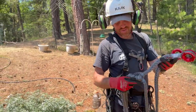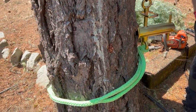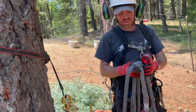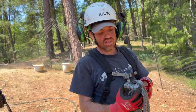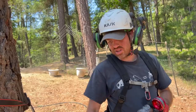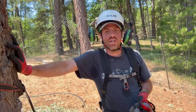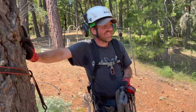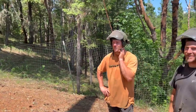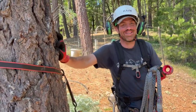The blade hitch is way shorter than, like, here is a whoopee sling, right? So you can actually get this sling really, really short. And also when the sling gets all ratty and pitchy, this is easy. You can just loosen it up a little bit, where the whoopee sling can get difficult to work with once it gets really dirty or ratty. And make sure the blade hitch is on there the right way. Don't ask me how I know. I wouldn't say this is advanced rigging, but you could do it wrong for sure.